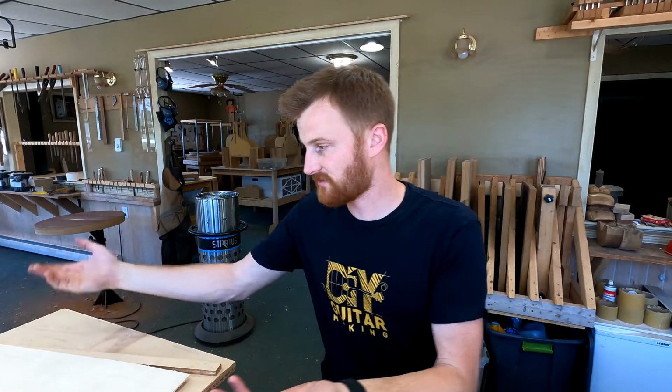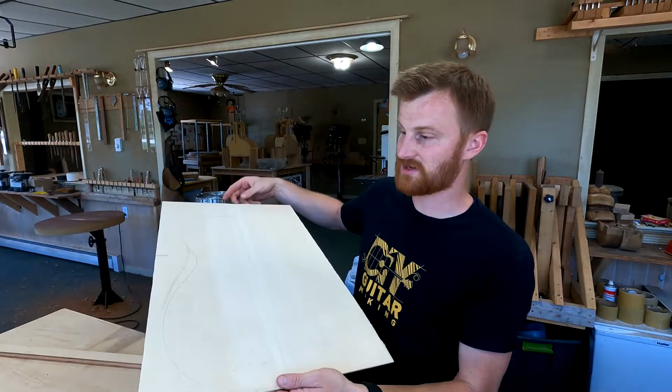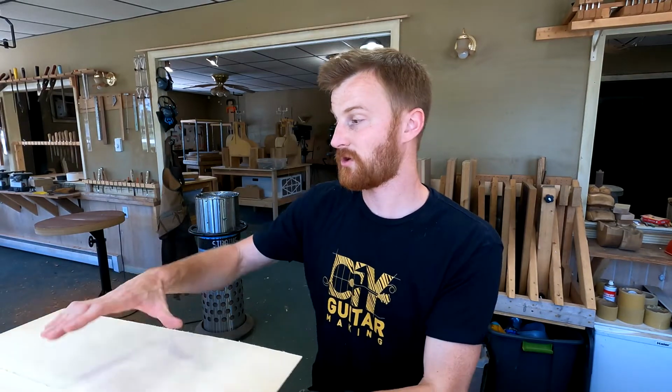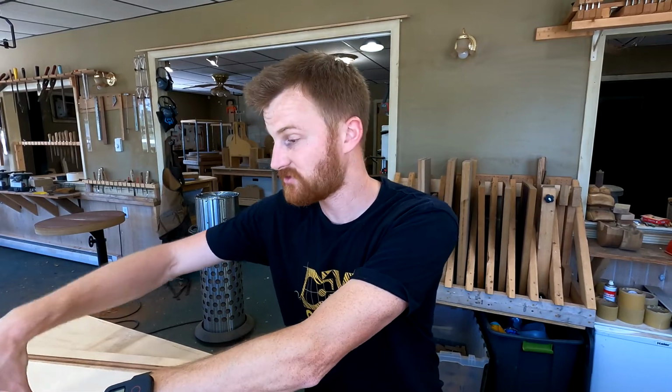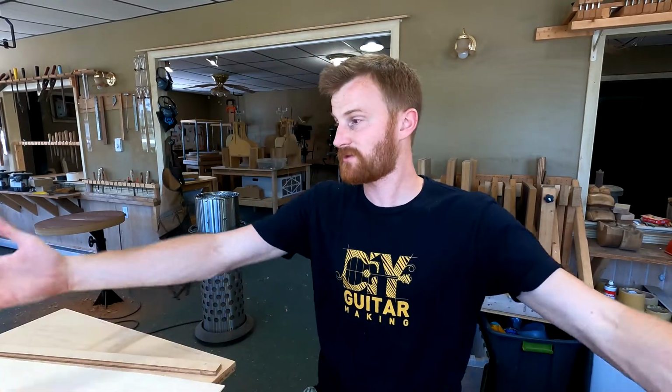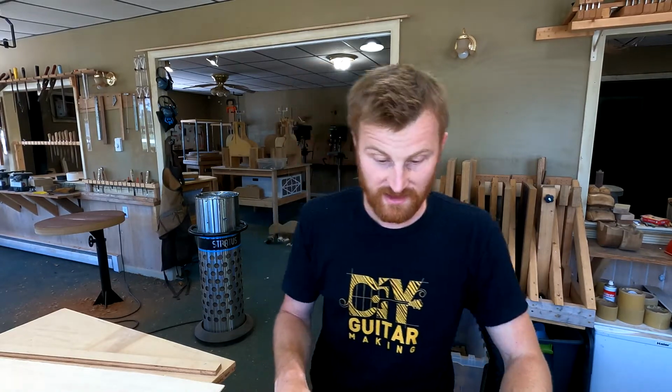What he's talking about is, we were just talking about the jointing process there. When he's jointing, and I'm assuming also when he's weighing them down on the joining board to connect the two pieces, I have all these big heavy weights here, which I just happen to have around the shop. If you don't have something like that, what Walter's recommending is cut the top off of an empty milk jug and fill it up with sand and leave the handle of the gallon jug on there. I think that's a great idea. Thank you, Walter.